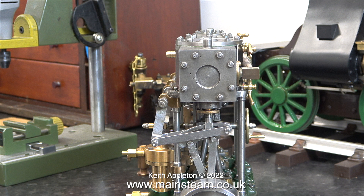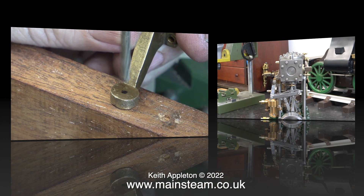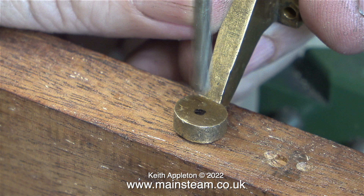The reason I turned up the air pressure too high was because the engine didn't even try to start. That is because the valve timing of the high pressure cylinder and the low pressure cylinder is incorrect. As far as I am aware, the valve timing of the centre cylinder should be okay as I made a jig to set that up. The next thing to look at is the operating lever for the air pump - there are some issues with this lever.